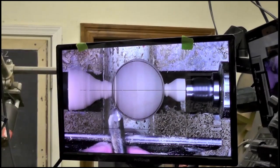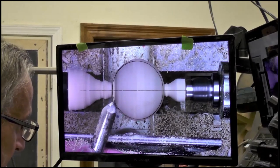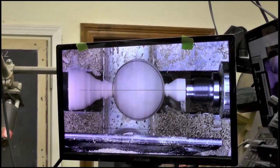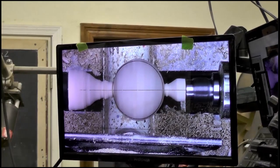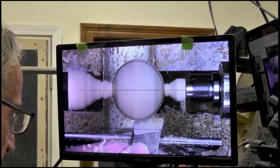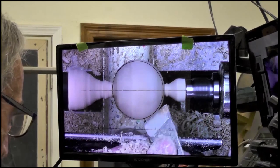You realize what this is doing for duplicating now? I can make two goblets that are just alike. And then I'll come in and do a final refine. That was a negative rake scraper — is that a negative rake scraper or a skew? This is a negative rake scraper. That's a skew. They look almost alike.